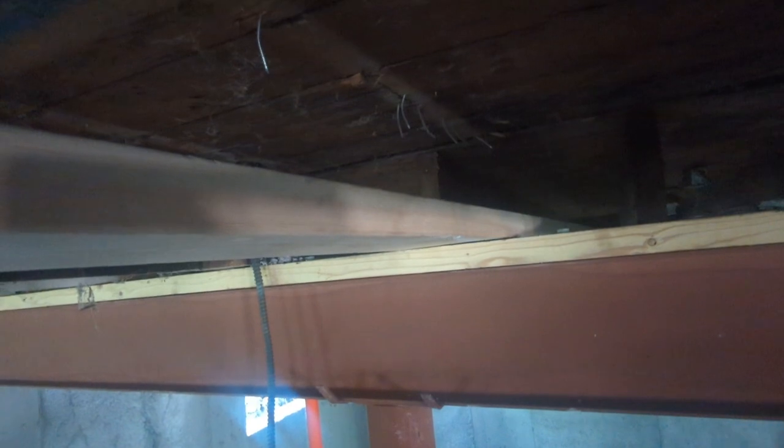And if we cut the existing landing back, we will do that. I doubt that we'll make it any longer because we're going to crowd our old headroom. The old stairs were steep, if anything, so we're going to drag the stair out longer. And I don't want to get any closer to the wall at the bottom of the stairs. That's not a best practice either. We've got a little under 2 feet before the beam and about 2 feet before we get to the basement door. All of this floor basically to there could be taken away if you didn't have a door.